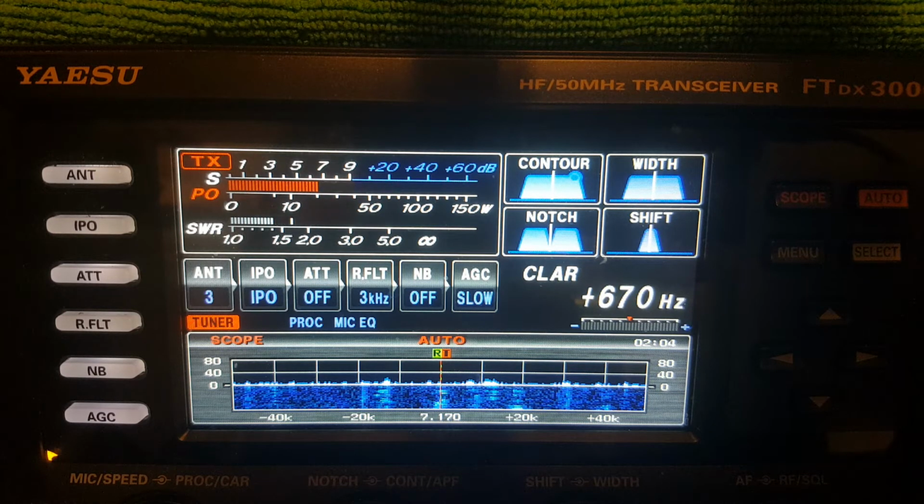Yeah, QSL, Todd. I use multi-tap UNUNs, which I've kind of concocted here, and I have a 7-tap UNUN right next to me, hanging on the windowsill, and clipped to the 64-to-1 tap is a 61.5-foot wire. It's a piece of speaker wire that goes out my shack window at a height of 6 feet and just goes across the yard on the top of bamboo sticks at about 2 feet high. Over. Any 10K Whiskey Delta Zero Tango.